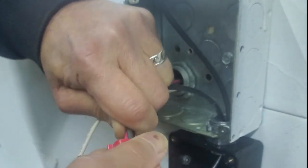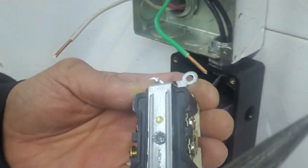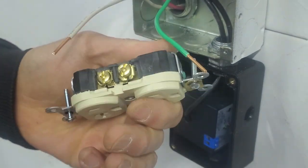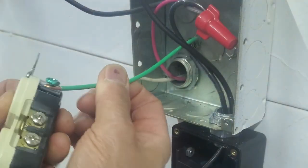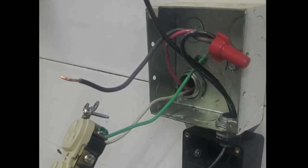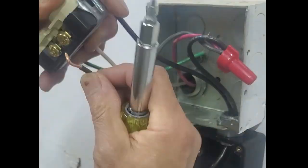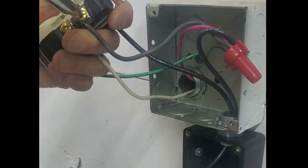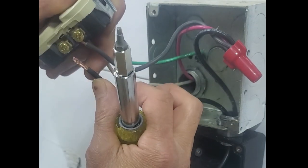The extra pigtail from the hot wire will allow me to wire the duplex outlet so that only one of the plugs will be used to trigger the blast gate, and the other will still be available as a general utility outlet. Removing this breakaway tab between the two hot-side screw terminals separates the power input between the two plugs. I think it's good practice to physically ground the outlet, so I'm adding the green wire. My electrical system is all run through metal conduit bonded at the service panel.